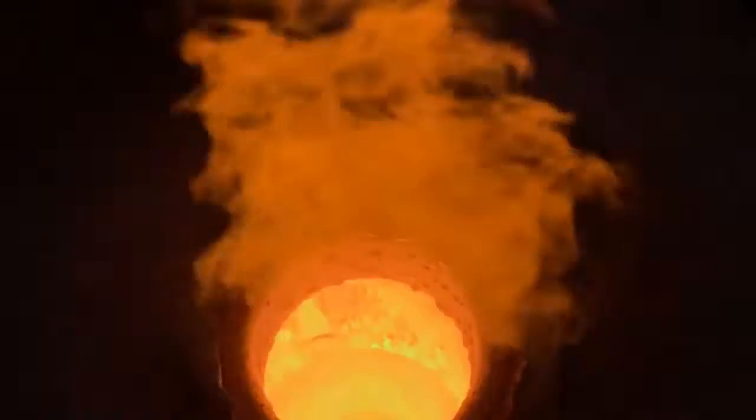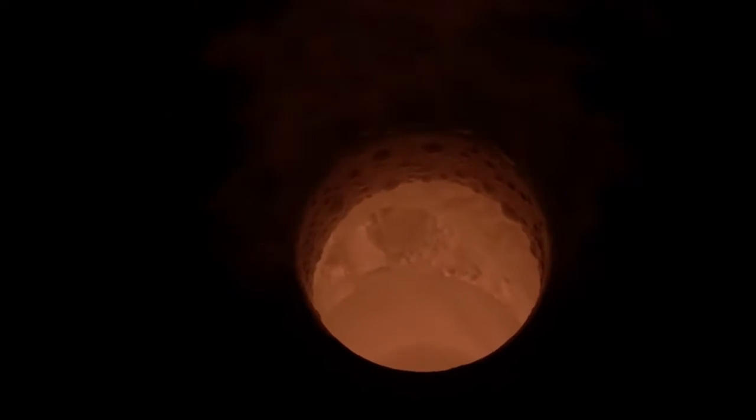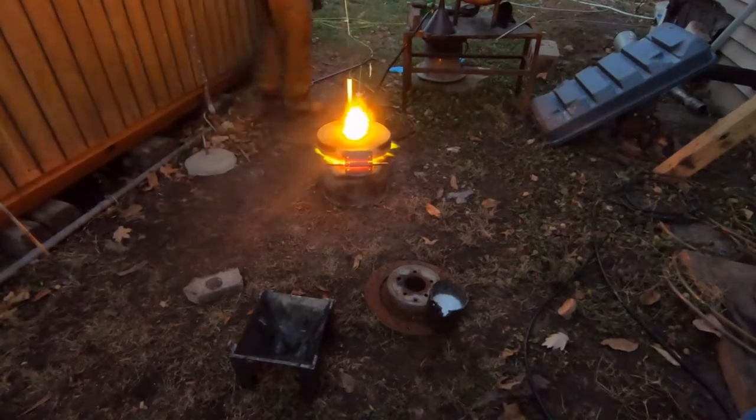We have some footage to corroborate that — it's kind of hard to see on camera, but there's a shiny blob of molten metal just above the lip of the crucible on the floor, right at the intake where the burner is. That shimmering ball of metal is about the size of a quarter — a huge blob of liquid stainless steel from the plate I used to help transfer heat to the bottom of the crucible. We officially hit 2650°F — that's 1455°C.